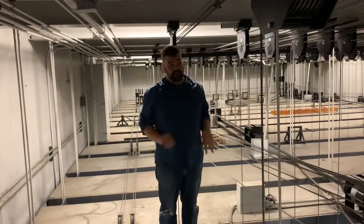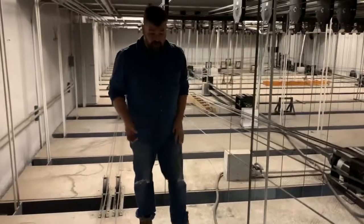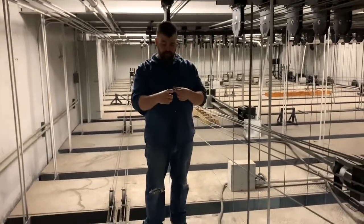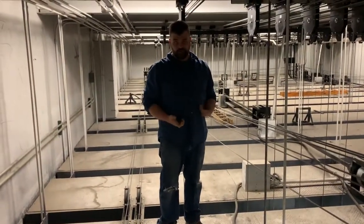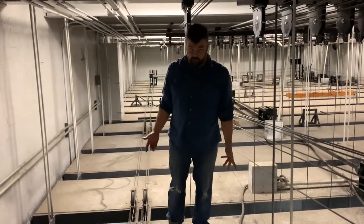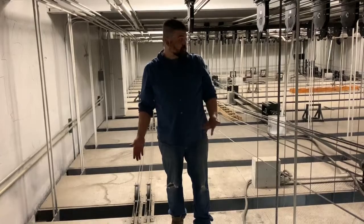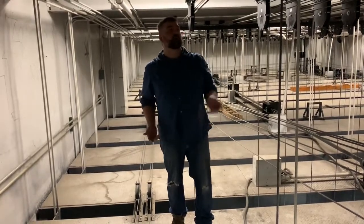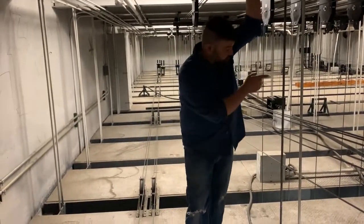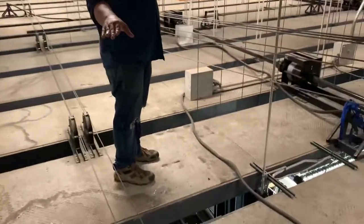When we're up here, there are a few things to think about in safety. One, we're really high in the air. At this university, this is a sidewalk. Normally when you come up here, you have ribbon steel — it's three inches across with about a two-inch gap in between each one, up to four inches. You can walk on it like it's a normal floor. The only part you really have to be concerned about is what we call moon bays or moon holes, and the areas where the cables from the loft blocks drop down and connect with the pipe.